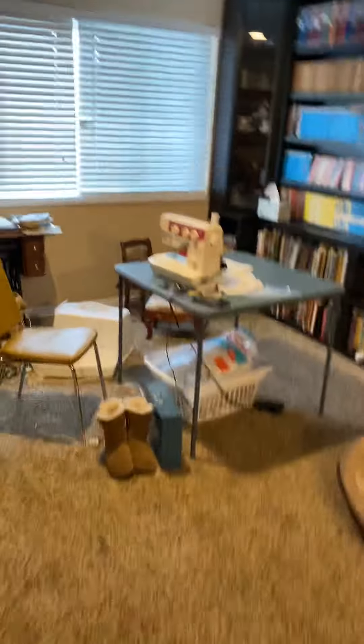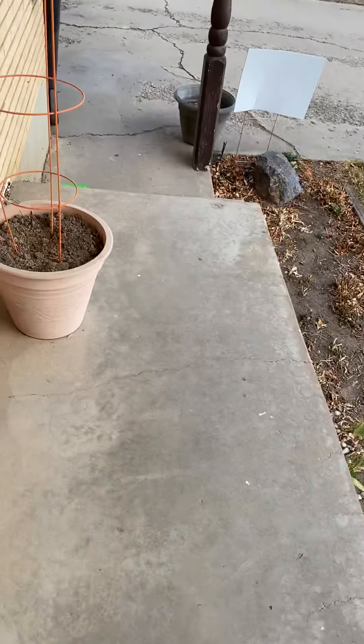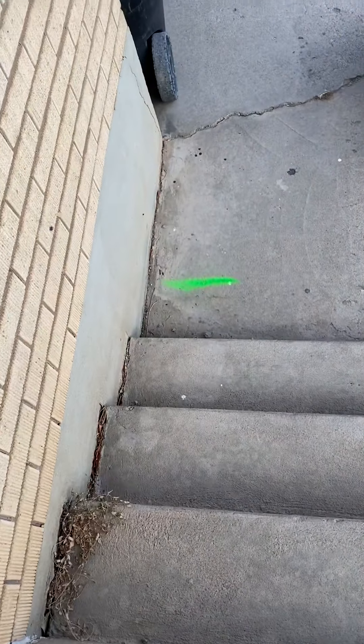On the interior underground — three feet long. I'm gonna take you guys outside. We're gonna be doing a spot repair of where it's coming out. The outside pipe is your transite or concrete, which is in really good condition, so we're just doing a spot repair on the cast iron going through the foundation. On the outside of the house here, it's coming through right here.